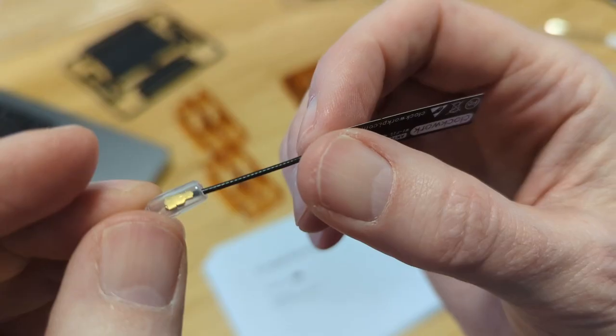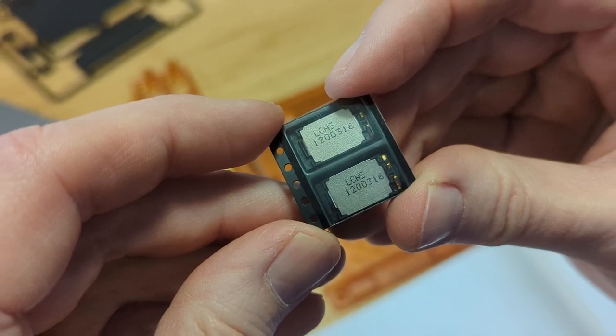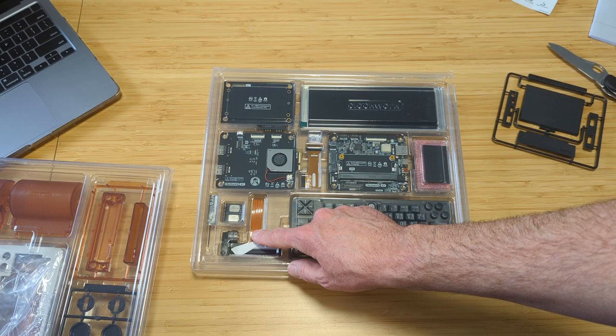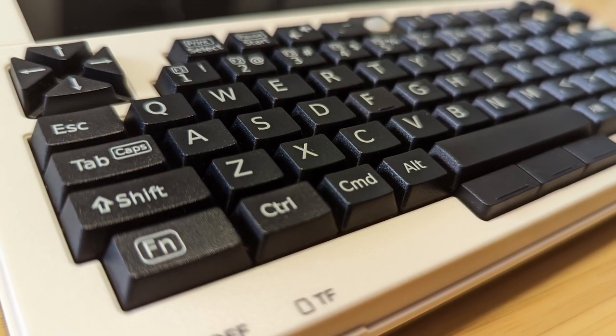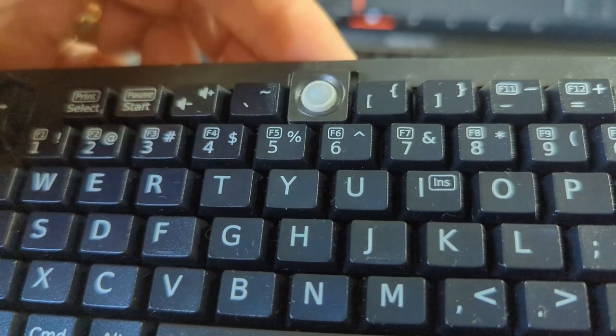To the right of the main tray is the core A06 processor. In the bottom row and to the left is a radio antenna for both Wi-Fi and Bluetooth. Next to the antenna are two small rectangular speakers — I've never seen speakers in this form factor and I'm really curious how they'll perform. Next to last is the thermal printer module — that's a cool retro touch. Finally, the 65% keyboard includes a built-in game controller and a rollerball for mouse control. Below the spacebar are three mouse buttons, and you can press the rollerball to activate a left mouse click. So there are all the parts — let's break them off the sprues and put the DevTerm together.